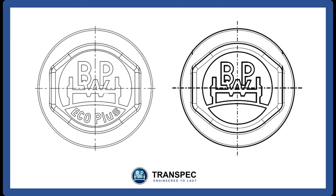The new Eco Plus 3 hub, with the correct seal, seal carrier, hubcap, and O-ring, will fit on the older Eco Plus axle beam. The older Eco Plus hub, with the correct seal, seal carrier, and hubcap, will also fit on the new axle beam.